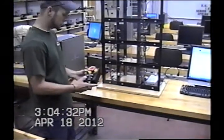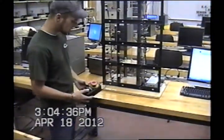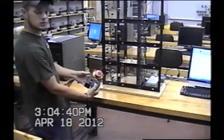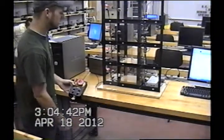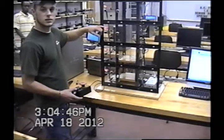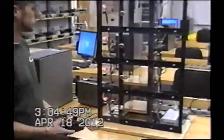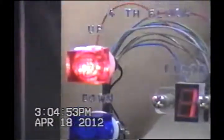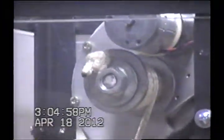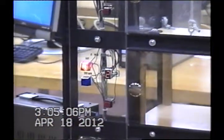I'll do a little demonstration. Right now we're on floor one. Say we want to go to floor two or three — we just hit the two button and it goes to two. The up light is on because that's the direction it's traveling. The reason it's so slow is because there's a large gear reduction on here — that's all we had at the moment. Now it's going to hit the proximity sensor on the side and stop at floor two.